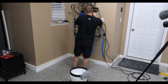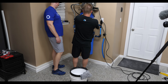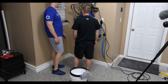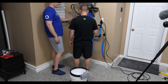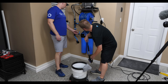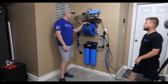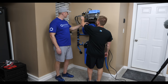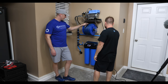Okay. We can pretend like we didn't turn it on. We'll just test it tomorrow, right? You're doing well. If that's all that we have is a little drip, we need to loosen this and retorque it. What we need is a big set of wrenches. You need like the 20-millimeter stuff. So I would get in the practice of always turning these off, turning the pump off, and popping the GFI. This is the part that drives people crazy, when you go through all this work and you have a little leak or something like that, but it's all part of the deal. At least it's up here. At least it's on that. We're good on all that.